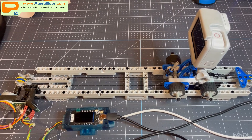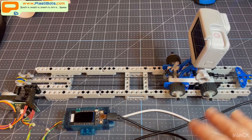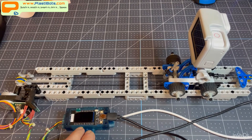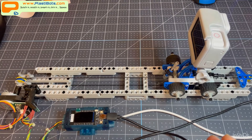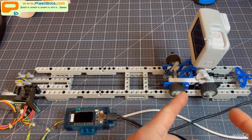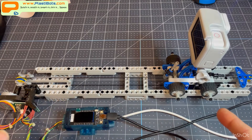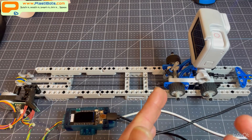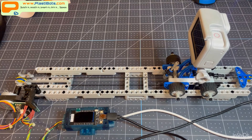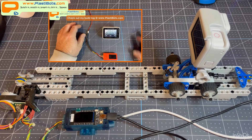I changed some hardware but essentially what it does is use a microcontroller - in this case a TTGO T-Display - using the total number of layers I input to do simple math based on the number of steps the stepper motor can do, to slowly track the camera backwards over hours while taking a photo with every layer change of the resin print. That's detailed in my previous posting, which I'll link again.